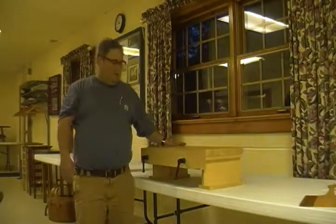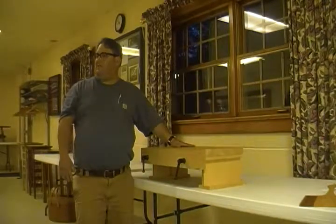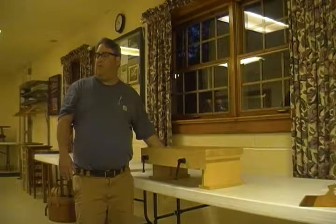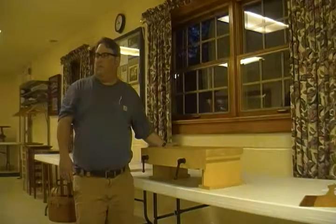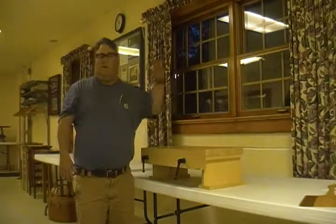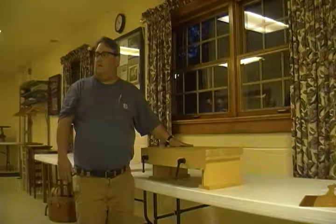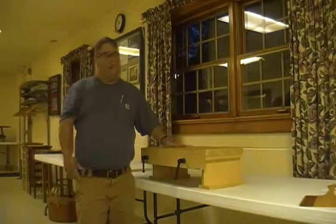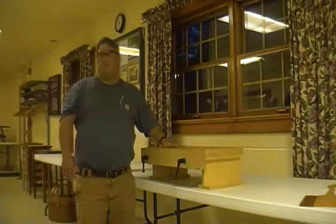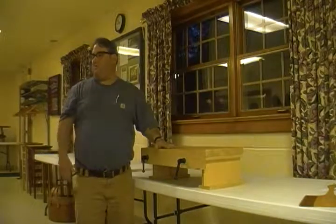I've only made one set of legs, but one of the things that Jeff Miller suggested at Argo is you can make lots of different leg sets. So if I wanted another foot up, I could make taller plywood H's. They're just screwed into the bottom of the bench top. You just unscrew them and put another set of legs on it that are taller or shorter, whichever. My only real complaint is I wish I'd made it just a hair larger. I wish I'd put maybe 24 inches between the screws. Yeah, we all do.